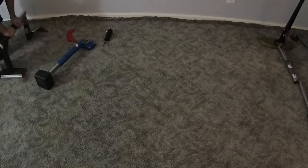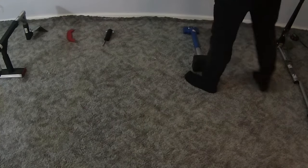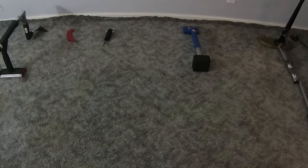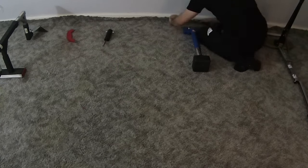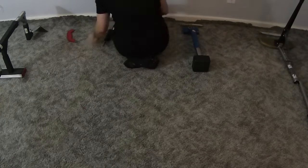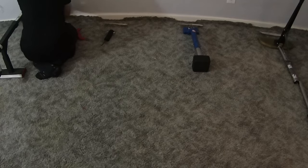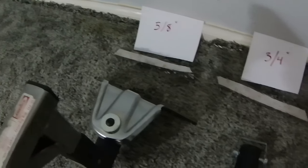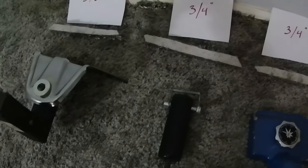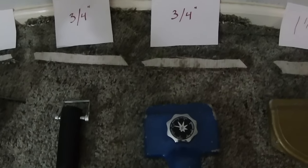I really don't recommend using these tools for stretching carpet. Now I'll go ahead and trim some of the excess carpet in each different place that I stretched, so you can see which tool pulled the carpet the tightest. Looks like the 711 Big Squeezy pulled about 5 eighths of an inch, the 737 carpet spike pulled about 3 quarters, and the knee kicker pulled about 3 quarters — which is surprising.